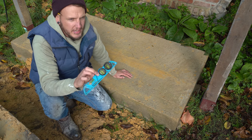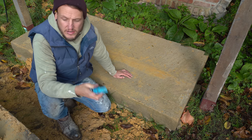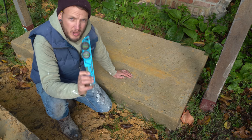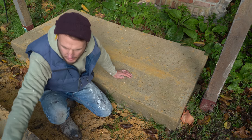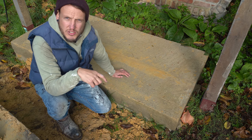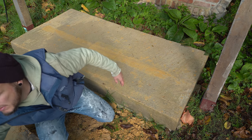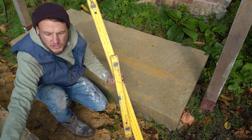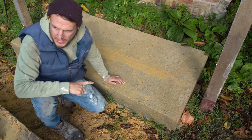I'll build it over here so we can see from both sides. We'll build up three or four courses. I know a couple of people have said they're having trouble plumbing up the first three courses. I would say just use a boat level for the first three courses. I did have a comment saying you shouldn't do that, but over the years I used to use a two-foot level, but I find it wobbles around too much, hence why I use a boat level for the first three.